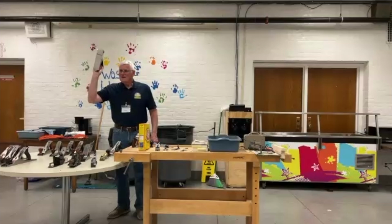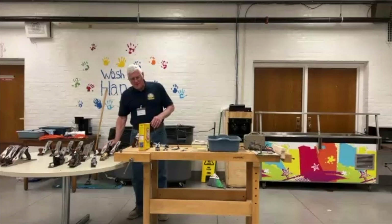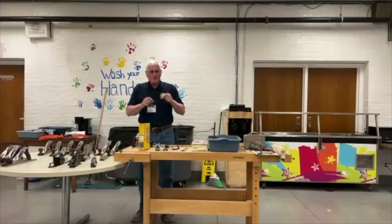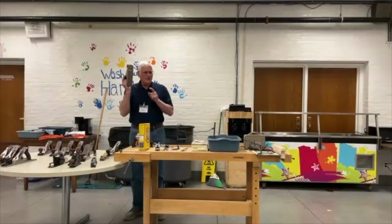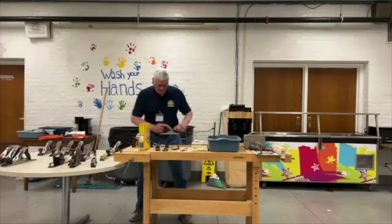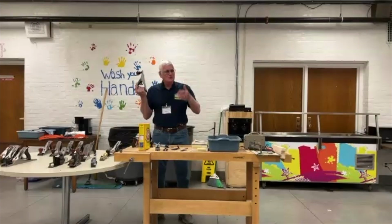Look at the bottom. Now I do take a piece of glass. I bought, I think it's 36 inches long, almost as long as this table, maybe not that long. And then I had sandpaper from my drum sander. Yeah, thank you. And I bought 80 grit sandpaper to use it on my sander, and it didn't work out as well as I thought it would. But I come to find out that 80 grit sandpaper is perfect for flattening the bottom of one of these, just starting. I use 80 grit back and forth, back and forth. And now when I do this in the future, I'll think $75, I could have this done, huh? $75. When I go from 80 to 120 to 180 to 220 to 400 and finally 1,000, because I want to shine on it.